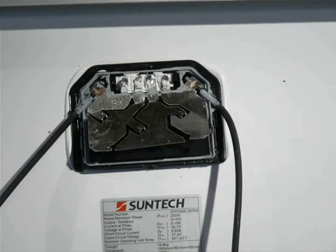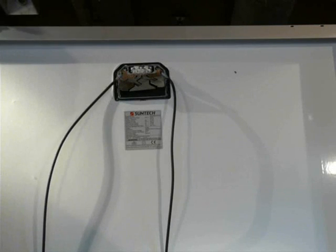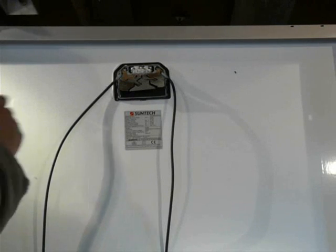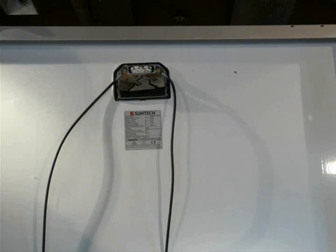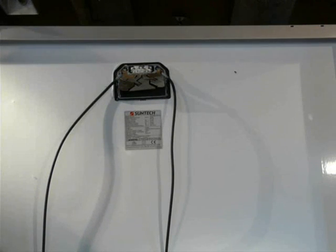Hopefully that makes sense. I did try this pair of panels across 24 volts and got five amps. So if you have damaged panels like this, you can't really repair them, but if they're free, put a coat of varnish on the front and use them for lower-voltage charging. Open circuit is 36 volts, maximum power point is about 30 volts — use them on 12 volts and you'll get something out of them. Hopefully we've all learned a few things, and I'll do some more experiments and post an update.